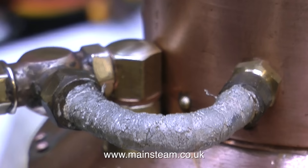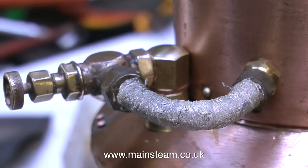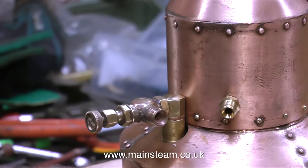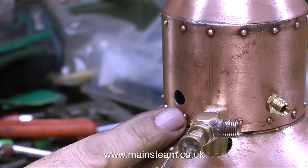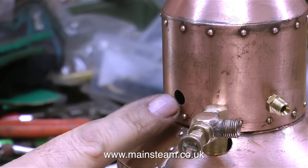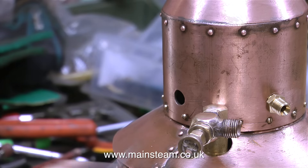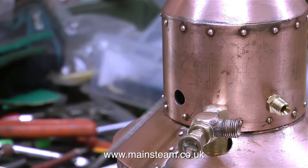I also took the opportunity to re-profile the hexagon on the tap, because it was very badly chewed up — this was long before I got my hands on it. I'm going to machine the hexagon part of the tap further down so it sits really neatly into my hexagon fitting. A word about the superheater arrangement: I'm going to make a coil with several turns of 3/16ths copper pipe, and this coil will be fitted at the top of the boiler inside the copper cover, and it will eventually exit by this hole that I'm pointing at. As the heat comes up the tubes, before it goes up the chimney, it passes the superheater and reheats the steam.